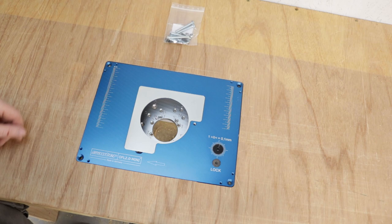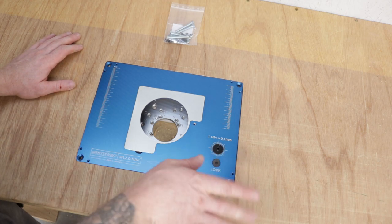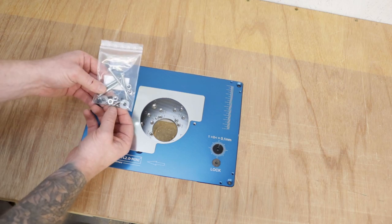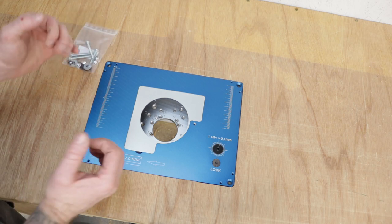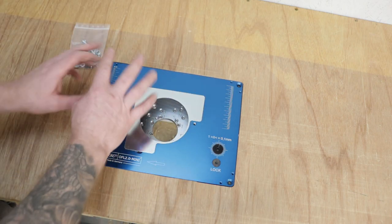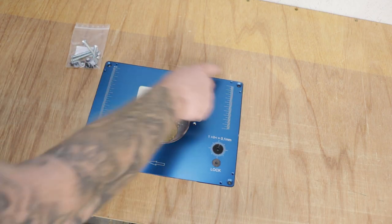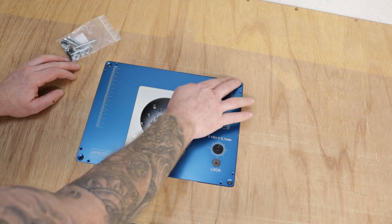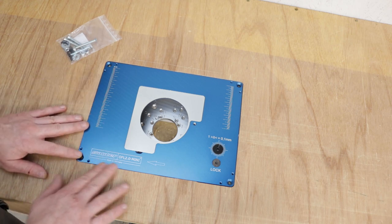There we go — all fit in, nice and simple. Just build a nice template and take your time. I have a tiny bit of a gap on one side but nothing that's going to affect the table. Now we're going to bolt it down. It comes with fixings and eight little grub screws — four main fixing points with grub screws either side, for adjusting the plate. So if you don't route it 100% correctly, you have a good bit of adjustment to get it perfectly flush with your top. I've got just four holes to drill, bolt it down, get the grub screws in, and get this flush.